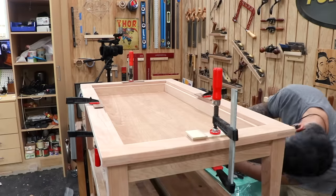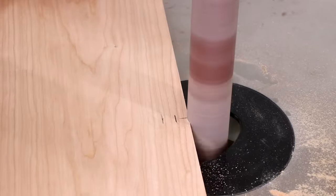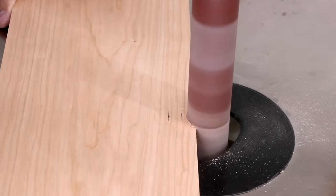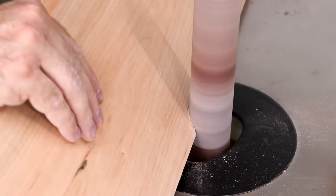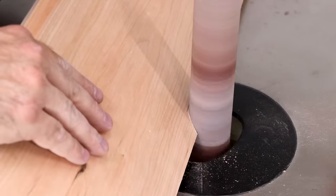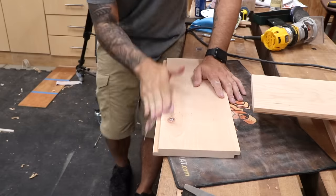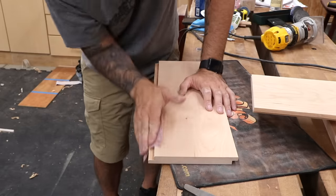For the coffee table, I'm including a simple finger hole. This can be carved by hand or done very quickly at the spindle sander by first sanding a semicircle, then tilting the board up at a sharp angle to give it a cool shape and make more room for the fingers. All sides of the top pieces receive a light round-over.